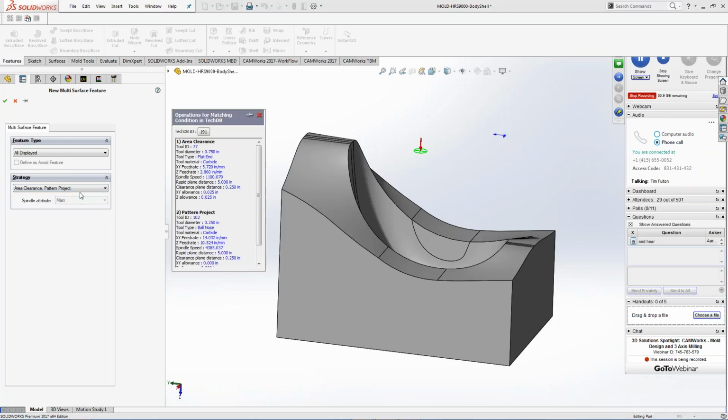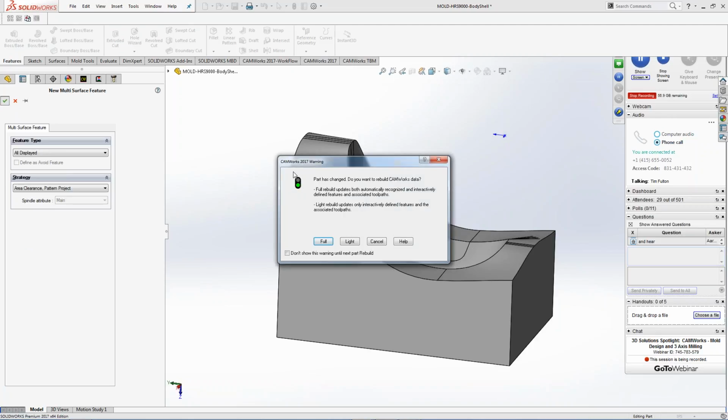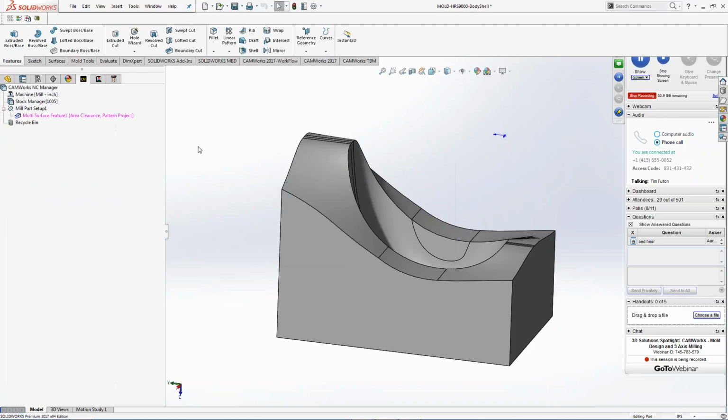I'm just going to pick the top one here, and it just kind of shows me it's going to be a 3/4 inch. It's going to be a 1/4 inch ball end mill. It's pulling out a tech ID number 191. I could go in there and make changes on the fly if I wanted to. Not going to get that today. So if I pick on the checkbox here, it gives me the information. Then I can start applying the information to this actual model.